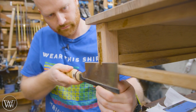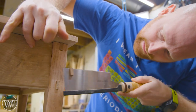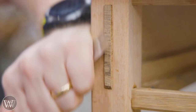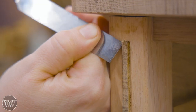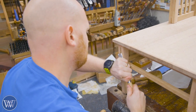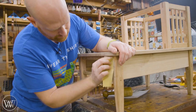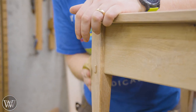After that I hit the scraped spots with a little bit of 400-grit sandpaper and we're ready to move on to the tenons. I prefer to shape tenons after the glue-up rather than before — if you don't do them perfectly before, they'll show up. I cut them down so they're sticking out a little over an eighth of an inch. I initially make them to stick out a quarter inch and then cut back to about an eighth inch so I have a little to work with. Then I come in with a chisel, bevel down, and slowly take them down. Just a quick touch-up with sandpaper afterwards, putting dust into the pores so it will draw the finish in a little bit more.